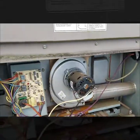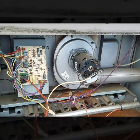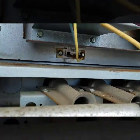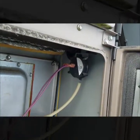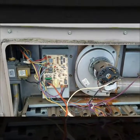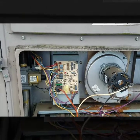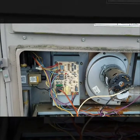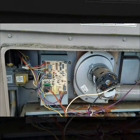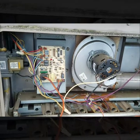That one fully didn't fire, so I went through all the limits as it was tripped out just to see if I could find anything quick and simple. I checked my flame rollout — everything looked good. Checked my high limit tucked in here — nothing tripped. My pressure switch was closed like it was supposed to be. So I recycled power to clear the fault code and found the ignition board wasn't sending power to my gas valve through the sequence of operations, which points to a defective ignition control board.